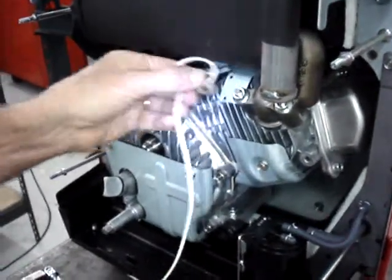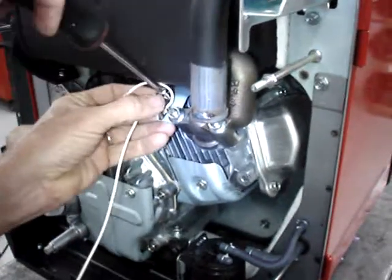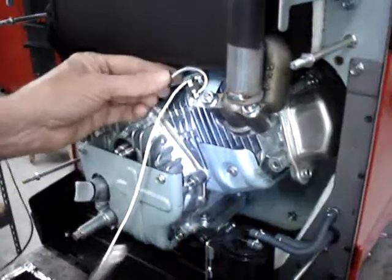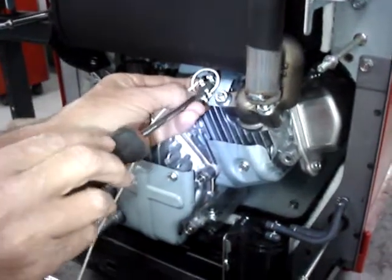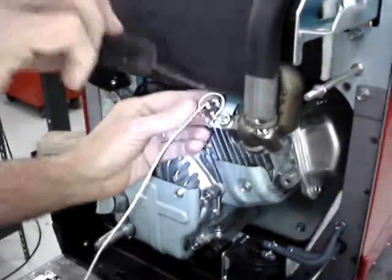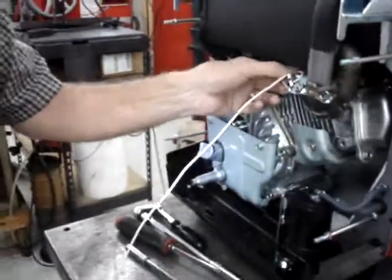So I'm going to put the sensor in place and put the top screw in. I'm just going to put it in a couple of turns, just to get it started. Then I'm going to take the ring terminal and wrap it around and put it around the bottom screw and then run the bottom screw through the sensor and then go ahead and tighten down both the screws. Incidentally, the drill bit that I used was a 1/8 inch drill bit. I don't recommend going to a larger drill bit because these screws can be turned down into a 1/8, and that way they bite nicely.